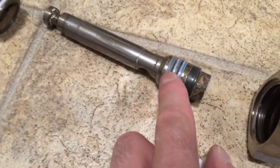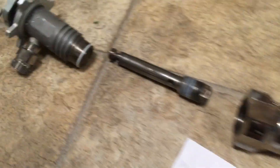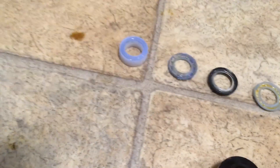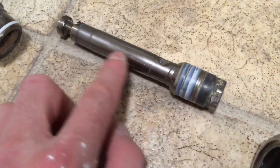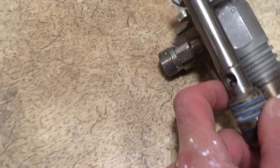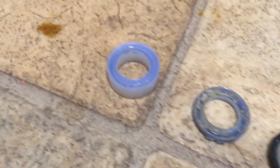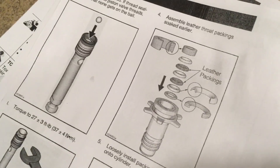These are throat seals — some plastic, some leather. Now this has had a really good clean. These are the other throat seals which all stack together and end up sealing around this shaft, which will be inside there, so they sort of seal around it at that point. These I haven't yet cleaned and you can see all the crud that gathers in them. That one I've cleaned. These lock together, so you've got a mixture of plastic and leather.